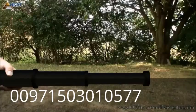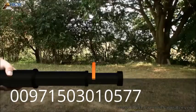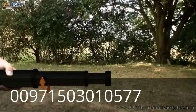If you like to minimize the probe, simply reverse the process. The left hand keeps hold of the upper segment all the time, while the right hand unlocks the lower tube by turning it away from your body. Now you can push the lower tube into the middle one and turn it towards your body to lock it. Repeat this procedure with the middle segment.